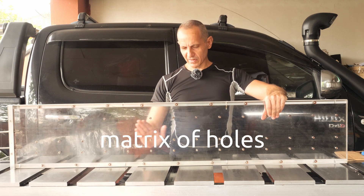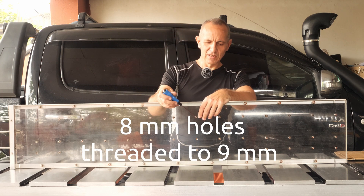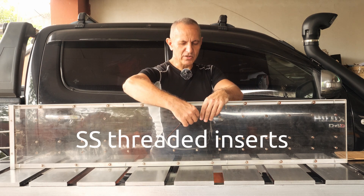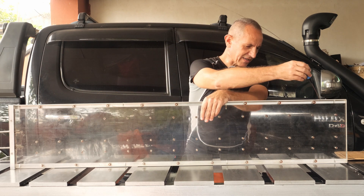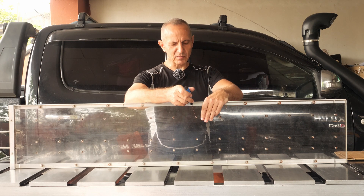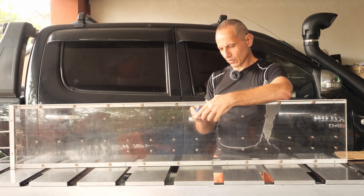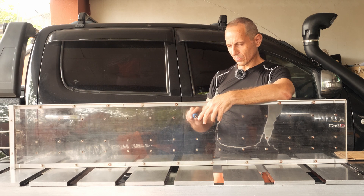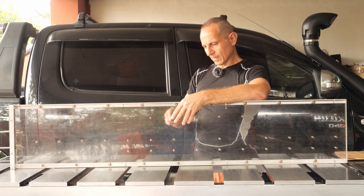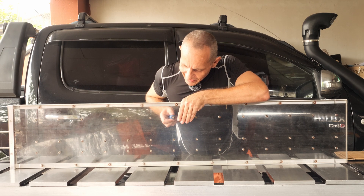The purpose of this matrix of holes: I drilled eight millimeter holes and then threaded them — tapped them to nine millimeters — and I used nine millimeter stainless steel inserts screwed into each hole. Each hole has a stainless steel threaded insert which is nine millimeters external thread and six millimeters internal thread, which allowed me to use six millimeter grab screws or set screws. These set screws are adjustable from below, from underneath the jig.